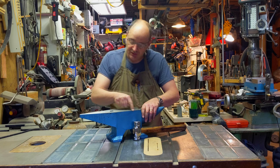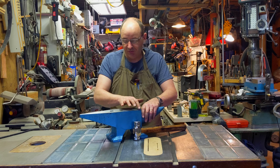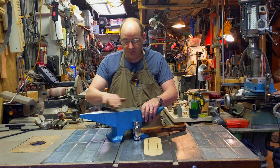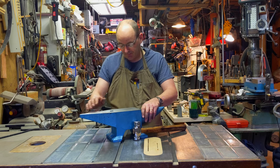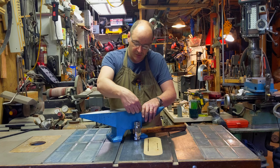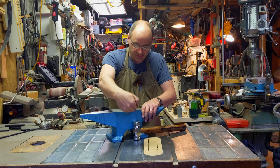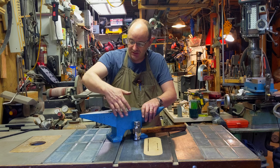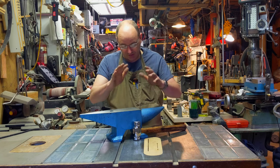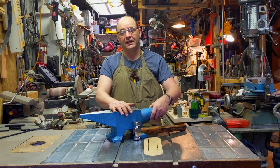And finally, soften these edges. I can actually feel a very hard edge there, even from a machining standpoint - that's too hard of an edge. It should have been chamfered. So I will take the flap disc and just soften those edges up. And, if removing the paint hasn't already helped, I'll probably clean these edges up here to make them flat-ish, so that anything I'm driving over the edges, I'm getting onto a nice flat surface. And then we'll mount it to an anvil stand, and I intend to make that stand mobile.